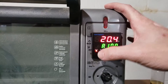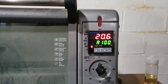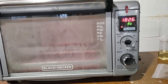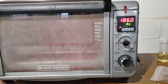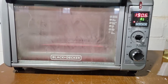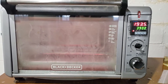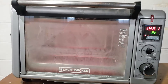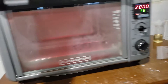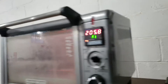I don't want the alarm. Let me get this converted over to Fahrenheit and we'll give it a shot. Okay, I've got it converted to Fahrenheit, set at 390 degrees, and I'm also running the auto-tune right now to let it configure the PID parameters for this oven.